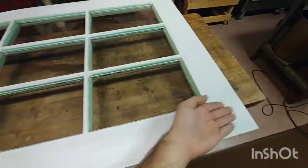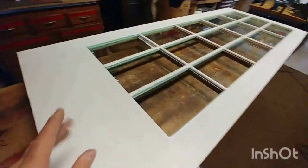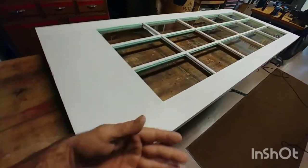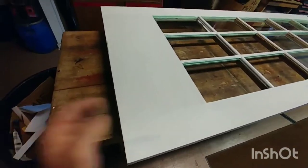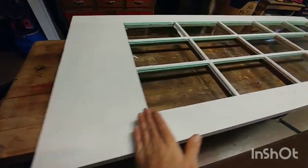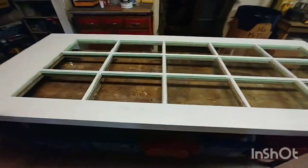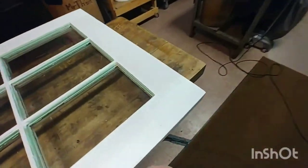So again, I did all the short runs because it doesn't dry that fast, and then I quick brush through their ends. If it's really a perfect breezy 70 degree summer day in the sun, you will have to brush through and quickly brush across and continue to maintain the cutoff and just leave that much here. And then later when I come through and paint, that'll get lost into the brush stroke kind of direction.